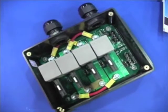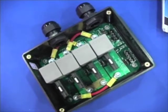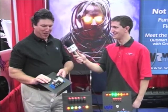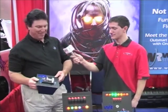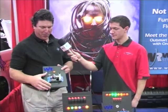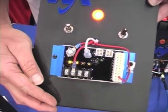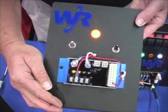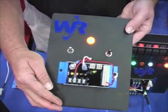So you're basically separating the design from your shop floor. So you kind of take all the stress out of it and make it a little bit more easy. Right. The idea is short runs, low current. And if you want, I'll be happy to show you some of these, how this might work. Sure. Okay. So if we start with the simplest unit, this is 4 outputs. This one we have programmed up to just be a timer. So all that's going to happen is this light's going to go on, and in 3 minutes that light will go out. Very simple program, sometimes very useful.